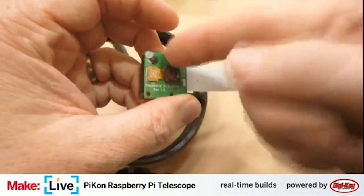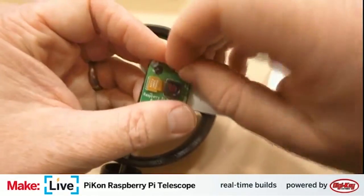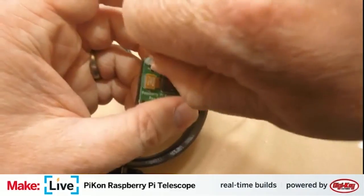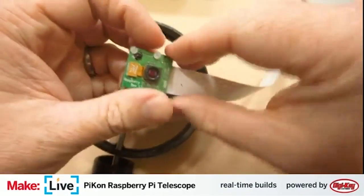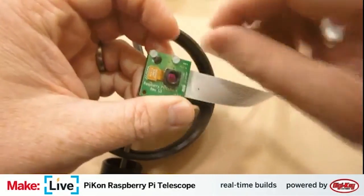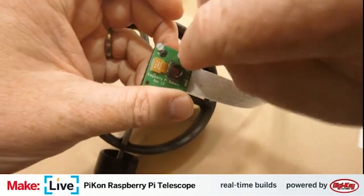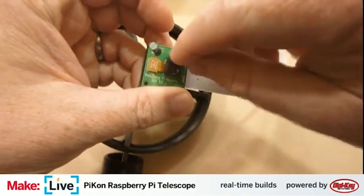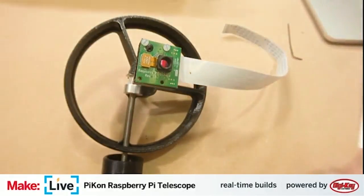The one side of it is it has less give. It's more brittle than ABS, and ABS is easier to post-machine and work with later on. So really see what your setup's like. If you don't have problems printing in ABS, then ABS is probably great. If you do have problems printing in it, then stick with the PLA or look at some other variants. We're also getting a lot of really nice high-temp PLAs now that have a lot less melt problems. So that could be a consideration.